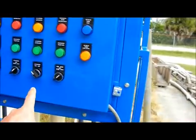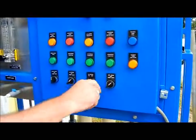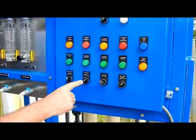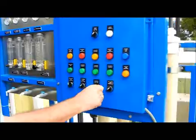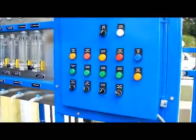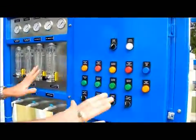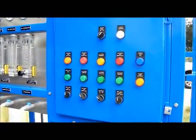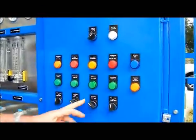When these are in auto, this filter position switch has no function whatsoever — it only allows you to control the operation when it's in manual. If you want to manually force a backwash right now, you put this in backwash and put this in hand and it'll force it to backwash. If you want to run filtration manually right now regardless of tank levels, put this in filtration mode, put it in hand, and it will run in filtration mode. So this switch is only functioning when you're in hand mode.